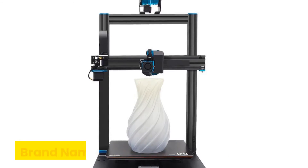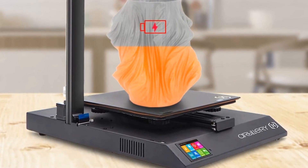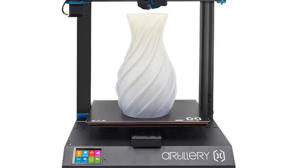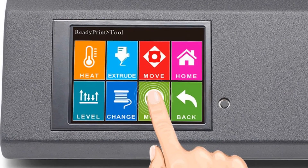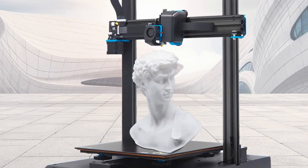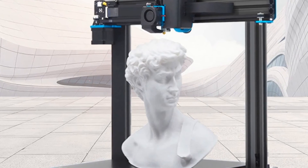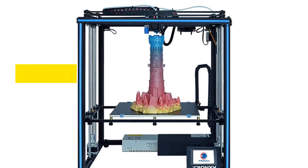Number 1: Artillery large 3D printer. Brand name: Artillery. 300x300x400 millimeters large plus size, high precision, touch screen interface. Interface type: USB. Print speed: 60 to 150 millimeters per second. Layer resolution: 0.1 to 0.35 millimeters. Travel speed: 250 millimeters per second. Print surface: glass ceramic. Heat bed type: AC heat bed. Number of extruders: one. Filament diameter: 1.75 millimeters. Supported materials: PLA, ABS, flexible PLA, wood, PVA, HIPS. XYZ resolution: 0.05x0.05x0.1 millimeters. Nozzle temperature: 180°C to 240°C. Nozzle heat-up time: 3 minutes. Build plate heat-up time under 2 minutes.